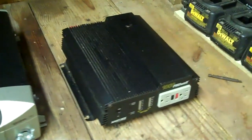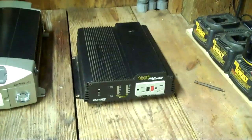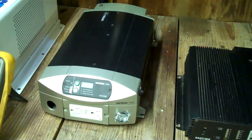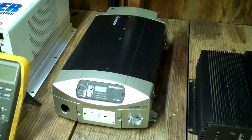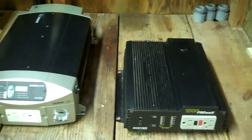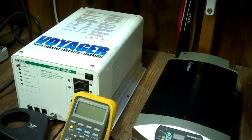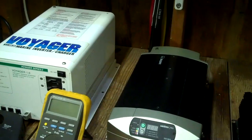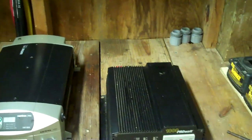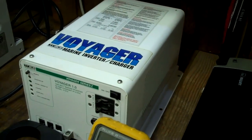The other difference to talk about would be pure sine wave versus modified sine wave. All of these are modified sine wave inverters except for that one — that's a pure sine wave inverter. The biggest difference is that things like refrigerators and some appliances are going to run hot on modified sine wave. Some things won't run at all — variable speed drills and some chargers for your drills won't run. Your fans are going to buzz and your clocks are going to run fast. I wouldn't try to save money buying a cheap pure sine wave inverter versus a really good transformer-type modified sine wave inverter — sometimes it's just not worth it.